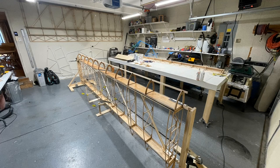I built a little jig to absolutely make sure each rib was true. All of my ribs are within 0.1 degree of being perfectly straight up and down. The root rib to the tip rib are the ones you can really only adjust — if the other ribs are off, you built something wrong. The root and tip ribs are within 0.1 degrees, and all other ribs are within 0.1 of that. It was straight.